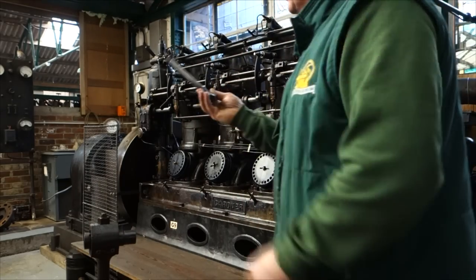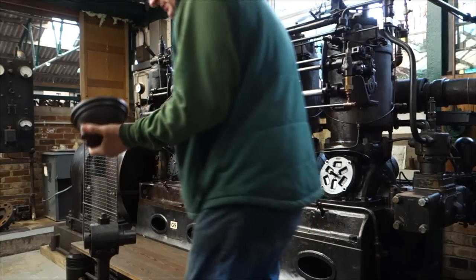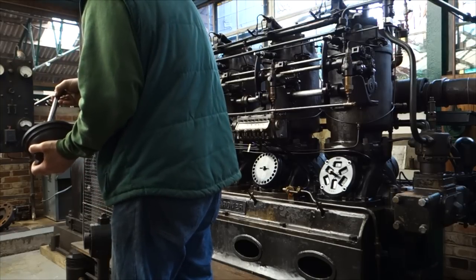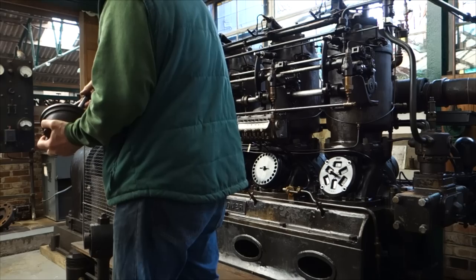The sprayers are quite novel. The cylinder head that I'll be heating has a hot spot on it, and the sprayer sprays fuel onto that hot spot. Then once the engine is running, you actually rotate that away so it doesn't go onto that very hot spot.